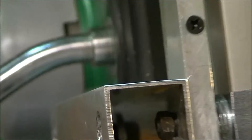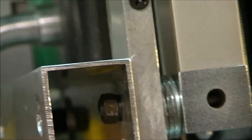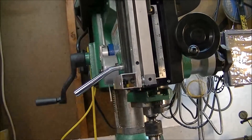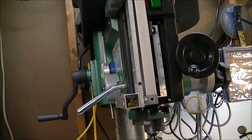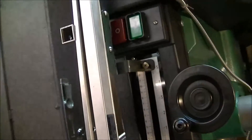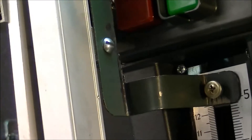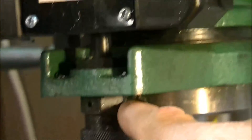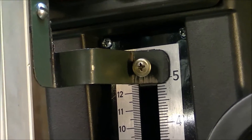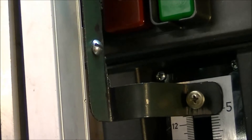Inside there is a bolt that goes all the way through that scale. That may cause me some troubles. I'm going to try to disassemble it and braze it up solid. Then I'm going to come around here where I've got this little arm, and I'm going to try to replace it with an arm that connects right down here, because this is more solid than the spot I connected it. I get a little jitter from this thing and I don't feel secure that I'm getting the right reading. So that's my project for today.